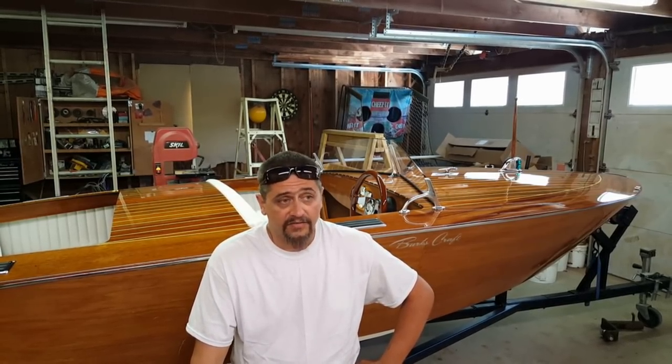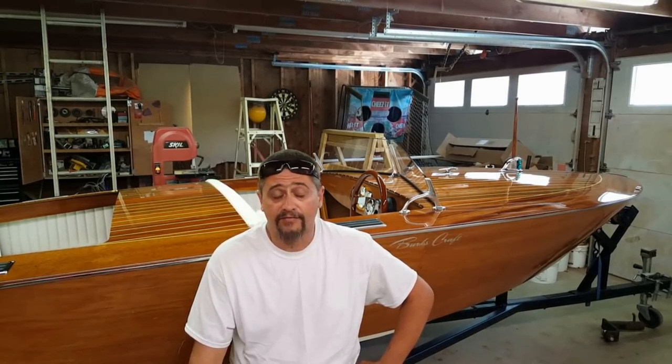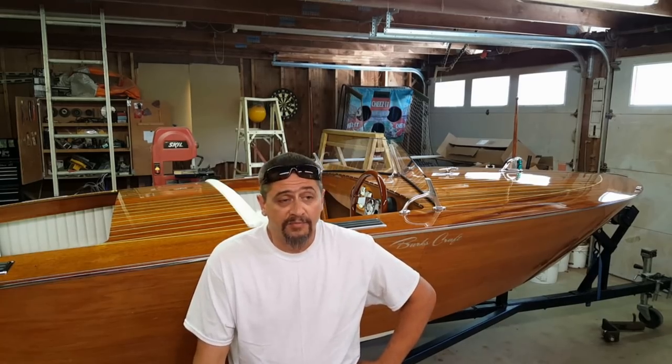But the truth of the matter is, finding short shaft outboards in 40 horse is getting very, very difficult. Again, I couldn't find a 40 horse, so I ended up with a 25, and fortunately, as luck would have it, I ended up with a good one that runs very strong and is adequate, plenty adequate. I'm very, very happy with that 25, and I won't change it. That's all I'll ever run on my Zip. But if I could recommend doing one thing different in a Zip build or any other boat for that matter, build it for a 20 inch long shaft outboard.